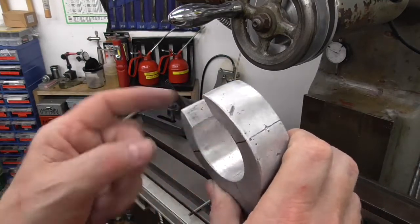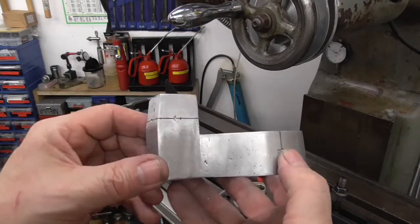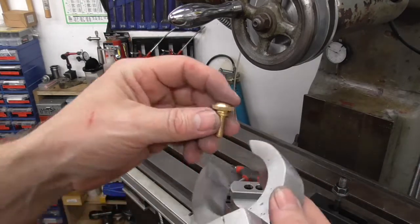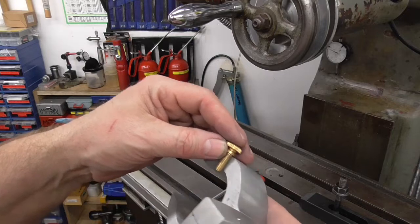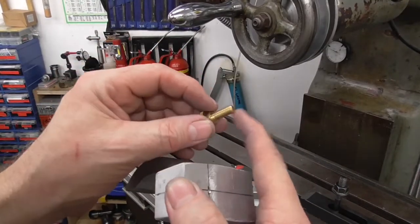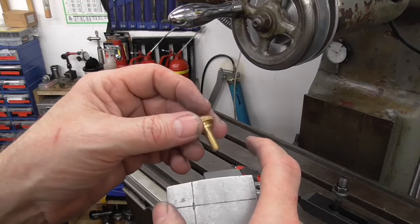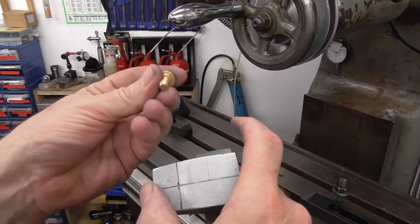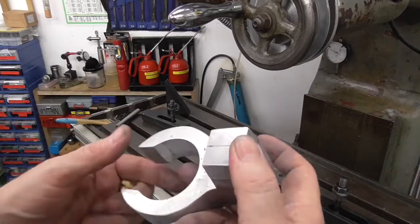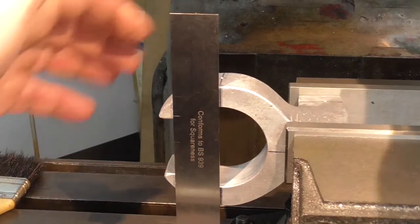I ended up getting a flat wheel in there and taking a little bit off. The casting isn't brilliant but it'll do for this job. I'm going to use some brass M6 thumb screws — they just need shortening slightly for the spindle clamp. I've got some smaller ones but they're plated so I was worried they might be a bit too hard when pushing into the spindle body, and M4 is probably too small and puts too much pressure at one point on the dial gauge spindle tube.